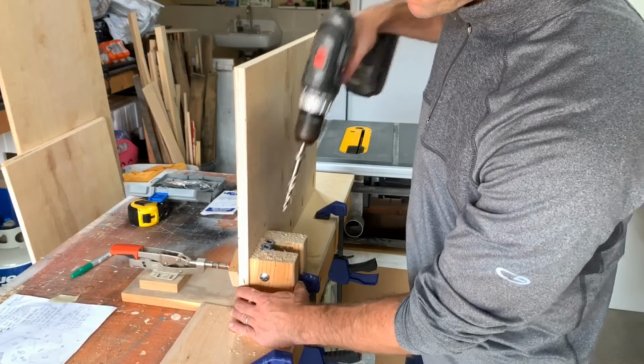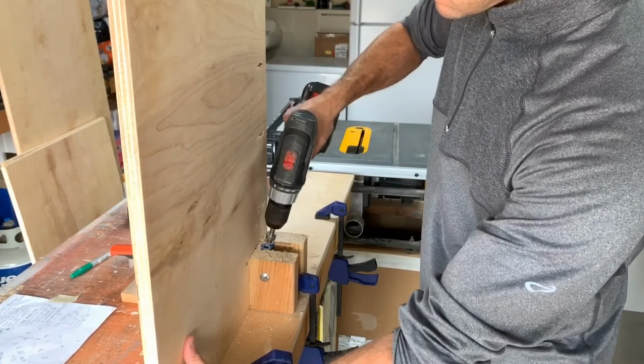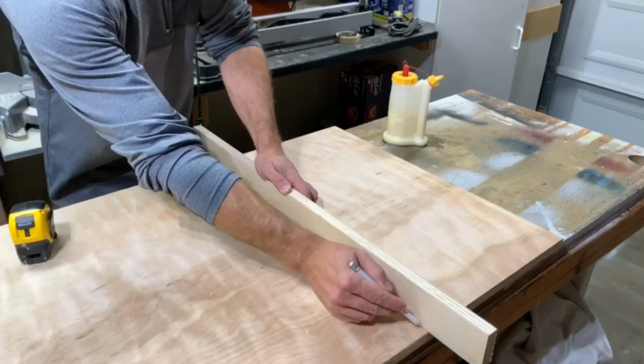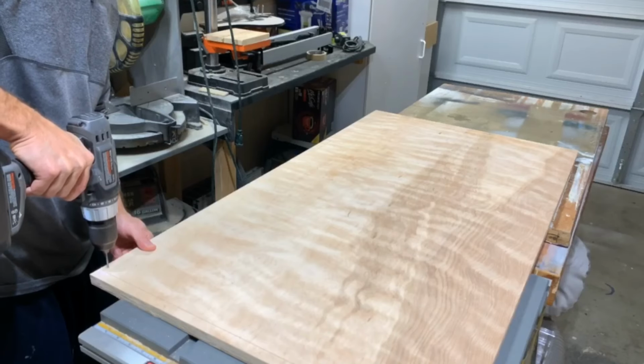I spent the rest of my morning drilling about 50 pocket holes on my DIY K4 Kreg jig. I have more to do later on this build, so I'll spare you the footage for that now. Next, I used a scrap to lay out the bottom of the cart. This helped me not only to identify where each piece went, but also to know where to drill pilot holes.